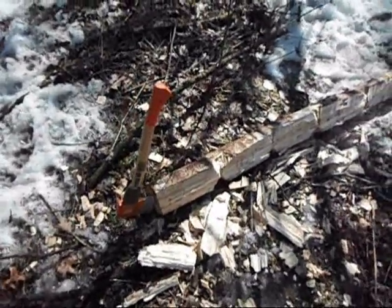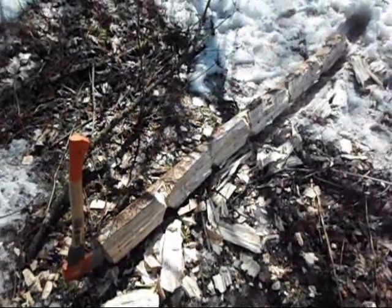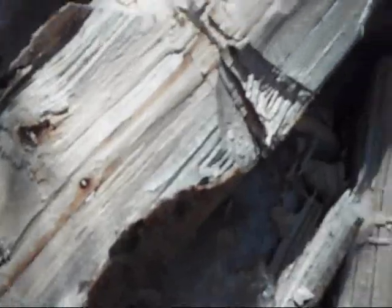Okay, roughly I've done the same thing that I did the other side. This time I made the notches a little bit deeper because once I looked at the side profile, I knew I needed to go a little deeper. So I'm using them as a depth gauge, those notches I'm talking about. Here, I'll get close up, maybe help. See, this time I went down a little deeper with those cuts. Try to show this a little deeper on this side. And that's kind of like a depth gauge to let me know when I'm getting close to the thickness of the wood I want.